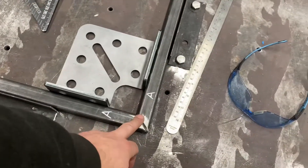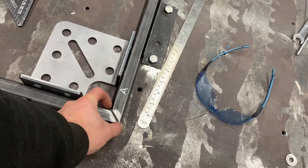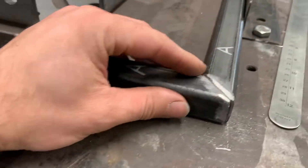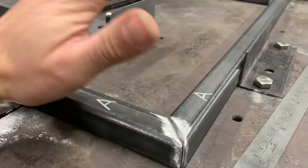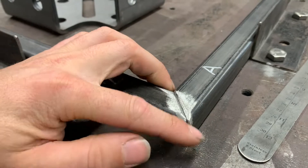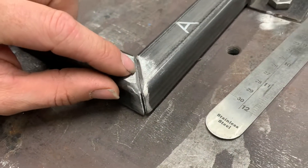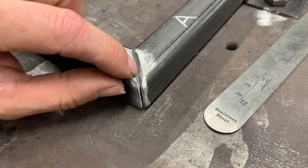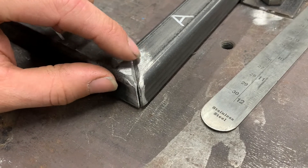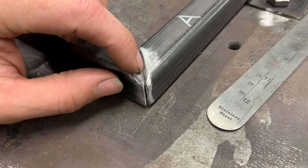This chassis he wanted 45 cuts, not square cuts. And I must admit with the 45 you've got a longer weld and you can get some nice penetration. So your joints - you've got to weld-prep everything when you're building a space frame or cage. Weld prep is very important, so you've got to clean all your material back. And if you look in there, it's chamfered all the way around. This is a three mil wall, so ideally you want a three millimeter chamfer.